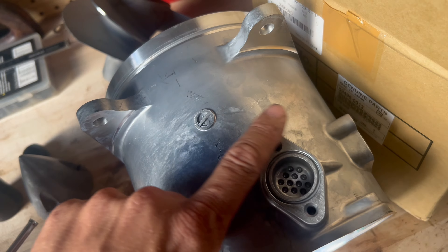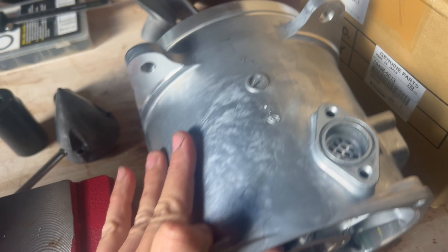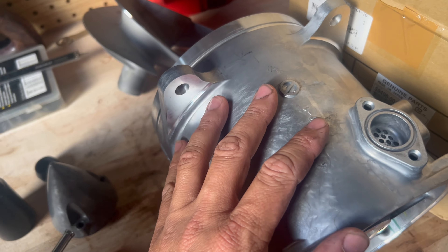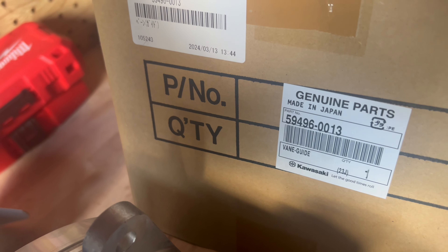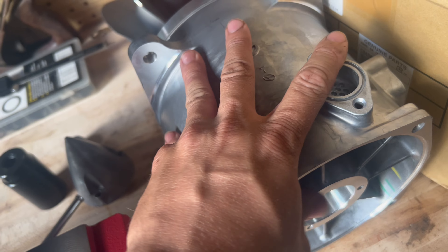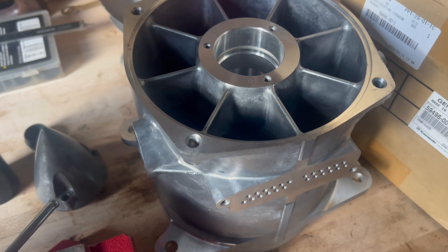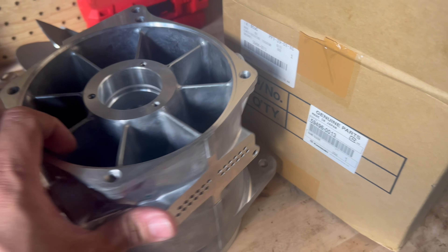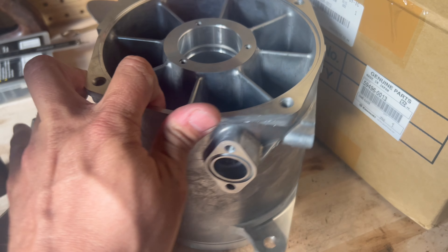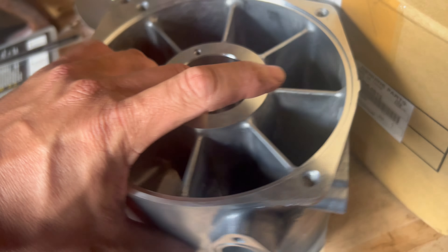I am very curious about this new casting on the pump. You can see it's not drilled — it's just right there. If you go to order a new pump from your dealer and order a 59496-3767, you might get old stock that looks like the original. But that part number has been superseded by 59496-0013. I only know this because I'm probably one of the few who's actually ordered this new pump, and I ordered it directly from Japan — not from a U.S. dealer. I ordered it from a supplier who gets them from the source. They told me this is the new casting, the superseded part number.